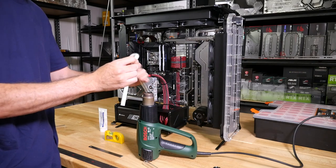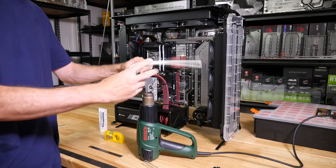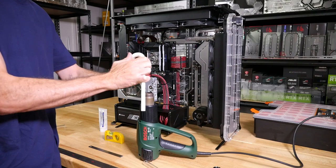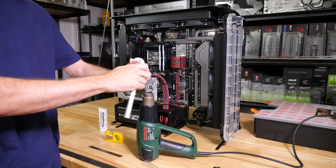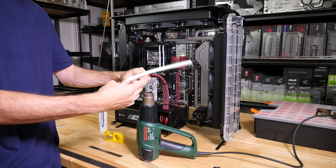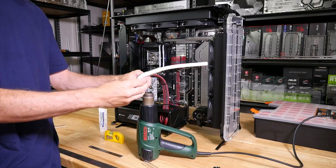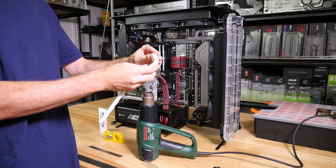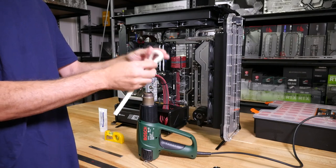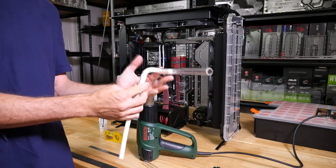What I normally do is run it under cold water when I have my bend. But I don't do this straight away, because when you're bending it by hand, when you first bend it, it's still so easy to bend that it's very hard to hold it in position. So as it's cooling down and getting harder, you can start making micro adjustments. By the time it's gone too hard, you should have finished your micro adjustments. Then you can quickly run it under cold water to lock that bend in completely so it won't move again. Also, if the tube is still quite hot, it may not be hot enough to bend anymore but it's still weaker because it's hot. So if you try to pull the silicone out when it's still quite hot, you can actually very easily break the tube.